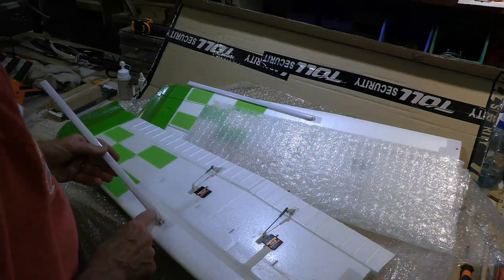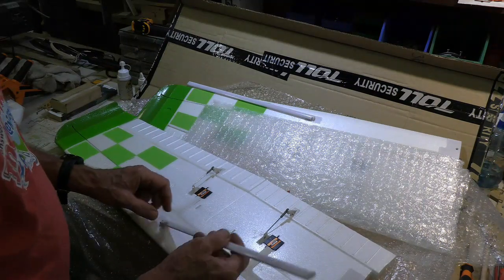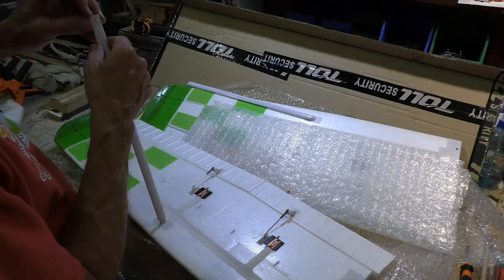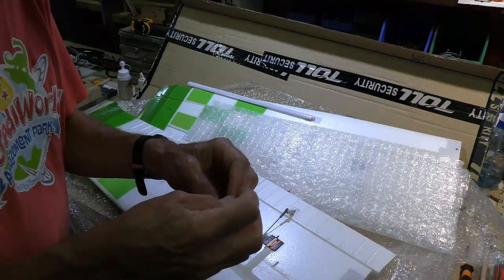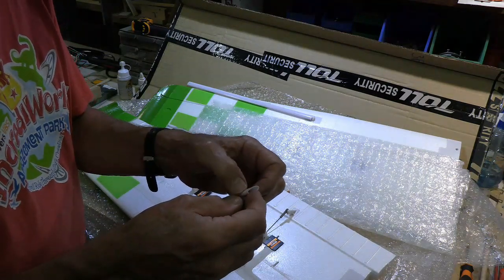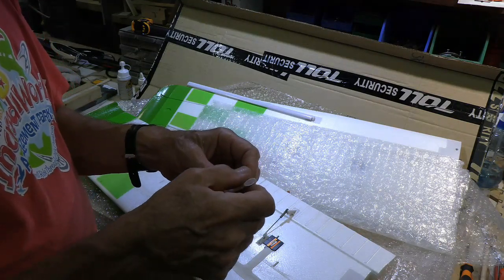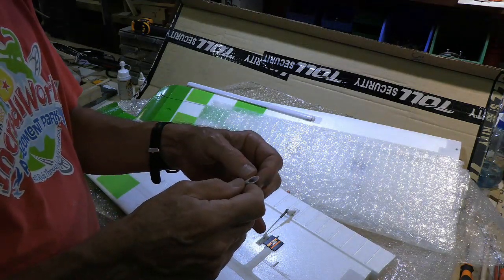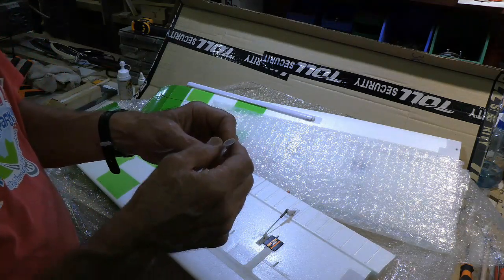And our repaired strut here is fine, or we did the repaired job. And up at the other end again, we got a longitudinal split next to where the pin goes through. So we might give some thought about some sort of fabric with glue on it to wrap around there and then re-drill it would be the best thing for that.